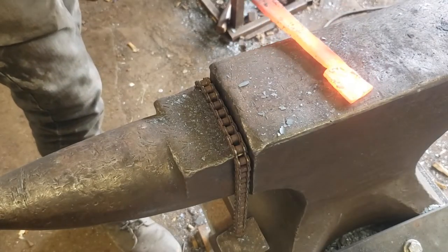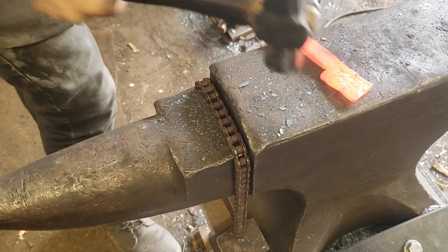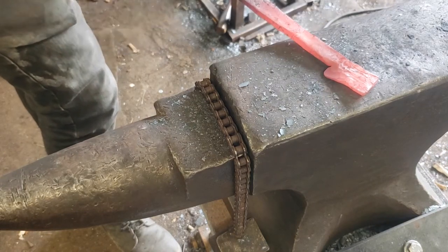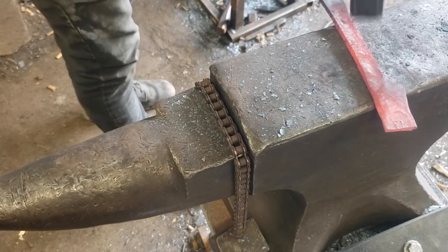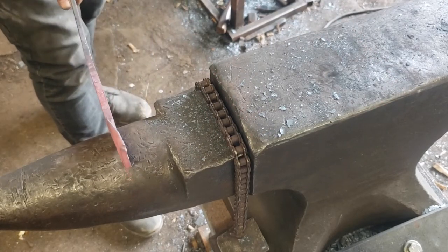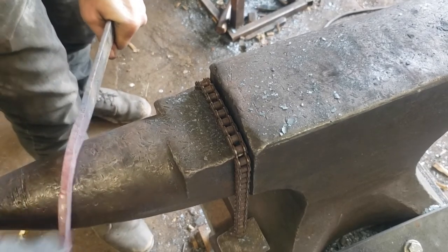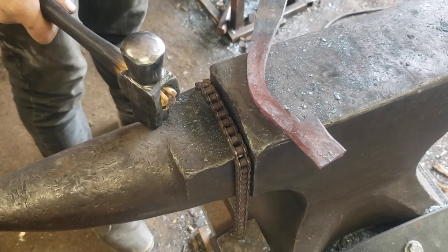Here's a strength of the rounding hammer — it's moving material in three directions at once, say on a shoulder right there on a knife. This is actually what it was made for: turning material the hard way on the thicker dimension, such as a horseshoe. That's why it was called a turning hammer. Hopefully that helps. Thanks.